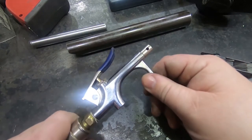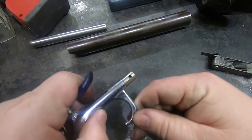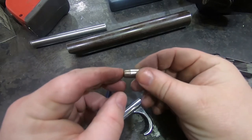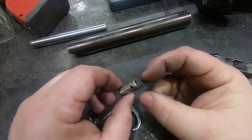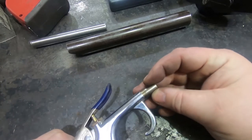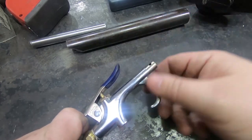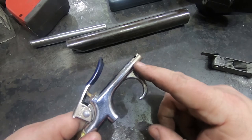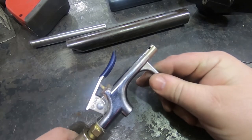I think I've decided on a path forward. This blow gun I have on the wall has a nozzle on threads, and as far as I can tell this is a 1/8-inch NPS — straight pipe thread, 27 threads per inch. So I should be able to make a replacement for this that gives me the wider aperture effects I'm looking for. That seems like the easiest way to prototype further — I can play with a couple different apertures and just keep doing it manually. It's a bit of a complication that I don't have the gears to cut 27 TPI on my lathe, so I'm going to have to get a die for that.